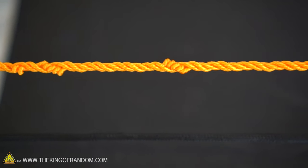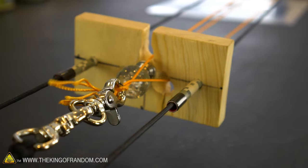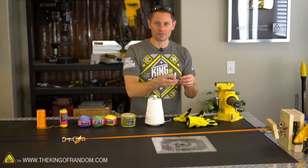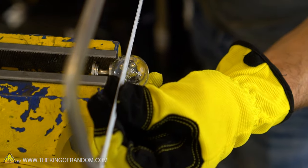Looking at the quality of this rope, it's still not what I want it to be. I think that's because the little ball I put on the back didn't actually get pushed — it kind of bypassed the ball and created a little knot. So I'm going to take that ball off, cut it in half, drill and tap a hole so we get a half moon crescent shape stuck on the back. Hopefully that'll guide it a little bit better.